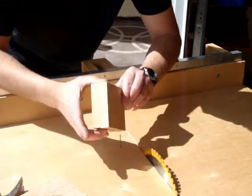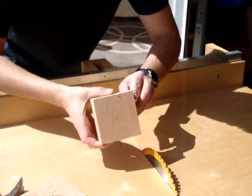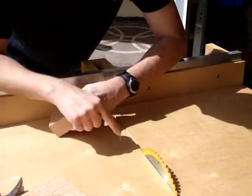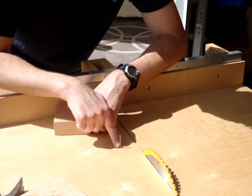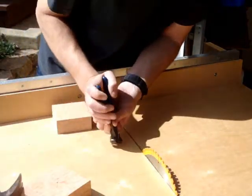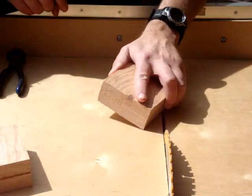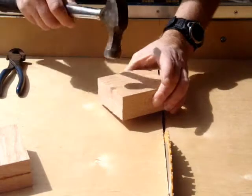I'm going to make the circles in my wood. What I've done is I've laminated two pieces of 3¼ inch oak together to make one block of wood. I've marked the center point and I've nailed in a small brad into my table saw sled. Next, I'm going to go ahead and clip off most of that nail. Now I'll just take my center point and place it right onto that tack.